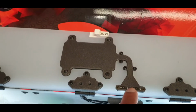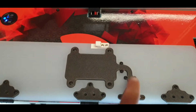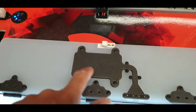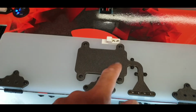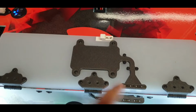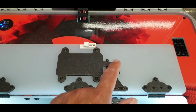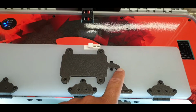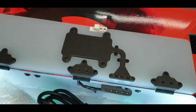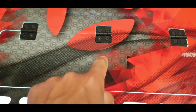I had to change a couple of the depths of the machining from the machining side and the polypropylene, but this is now printed in one piece, which is nice because it keeps the wireless charging antenna, I call it an antenna, but it's not, the wireless charging coils, and its wires and its connections here as one module. So I can create that as one module, use some hot glue to keep the wires in place, and then I undo the bolts and it just literally slides in and out without any fuss. So that obviously makes contact with the wireless charger, which is mounted around here.